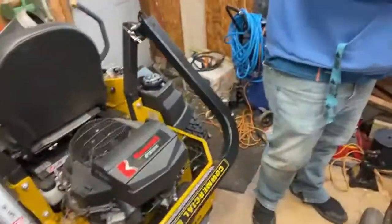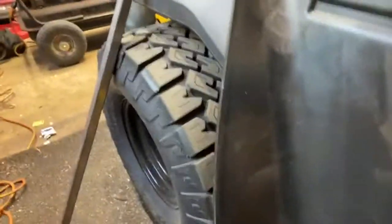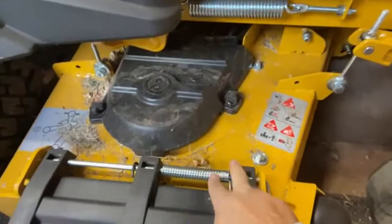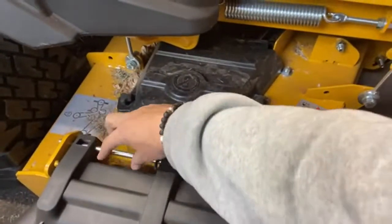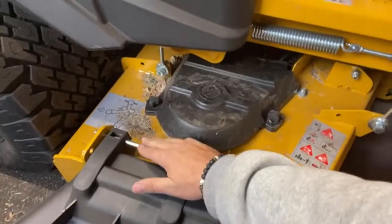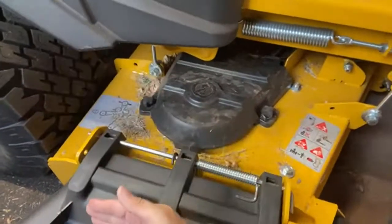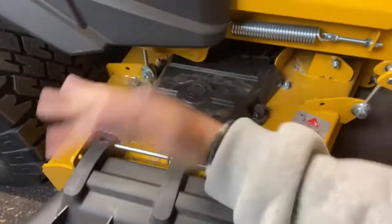We're gonna do measurements, and the way this is gonna work is we're gonna use the factory existing spring. So we're gonna take this off. Matter of fact, we can now, because we got to take that apart anyways. Take your existing spring, this right here, and move it to the middle. We're going to use the square tubing to go right here and create a sleeve to run our welds on. Ranger's going to do the welding. And make a plate out here and straight down, and a plate here. And you're going to use this spring in the middle to create our tension.